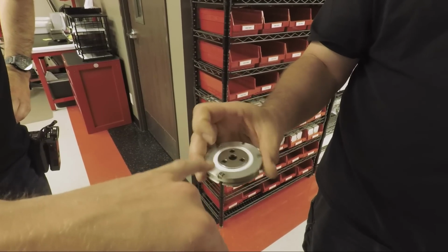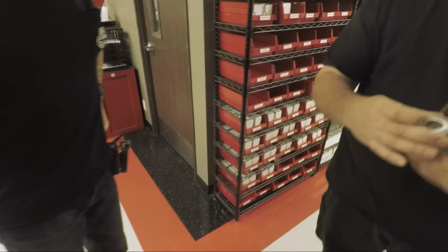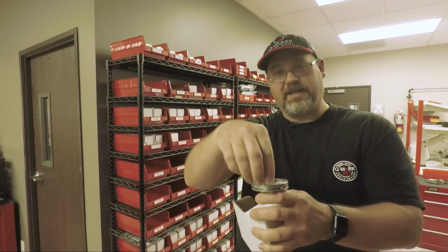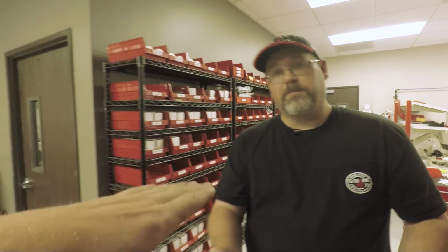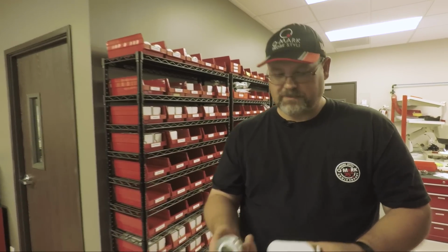And that's a magnet? No, these are the rollers. The head itself has two spheres, and they sit on either side of those in three places. That keeps it flat. So this is incredibly important, because there's a machined shoulder that dictates the perpendicularity of the tool coming off that cube. Interesting. But you don't have to grind that. It's machined. That's cool.